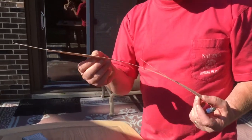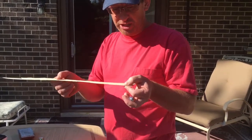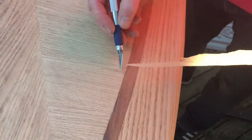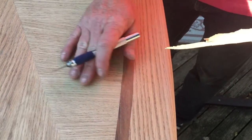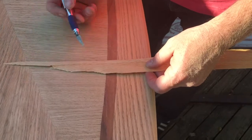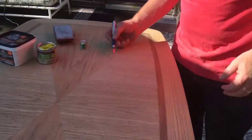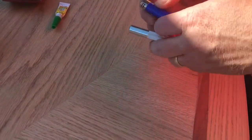A lot of times what I like to do is use natural wood again. Here is a scrap piece of red oak veneer - veneer is just a real thin sheet of natural wood. I'm gonna cut out a piece and glue it down with super glue because it dries fast, then sand over top of it. I'm making sure my grain direction and color are close.